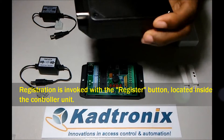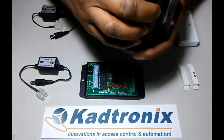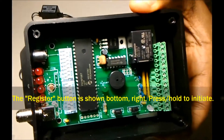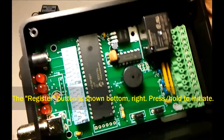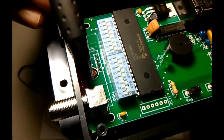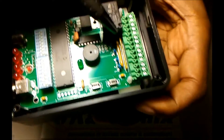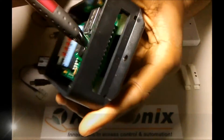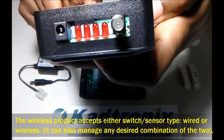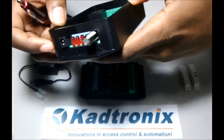The wireless controller is secured by four screws which keep the lid intact. Once removed, the lid separates and you see the internals are pretty much the same as for the wired system, with just a couple of differences — one of them being the antenna connector. You can see the configuration DIP switches, the relay, and the wiring terminals, which are accessible from the back. The indicators are viewable from the front, unlike the wired system where they would not be viewable from outside the package.